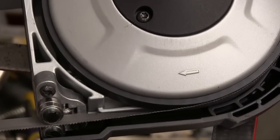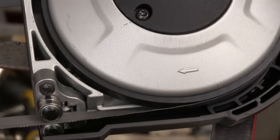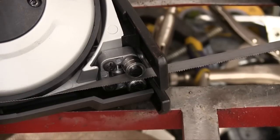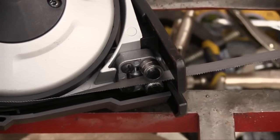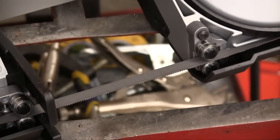The design of these tires and the rest of the blade drive system keep you from having to adjust the tracking. Because the blade has to be twisted where it goes through the blade opening, Milwaukee builds in these tough ball bearing guides. There are identical sets of ball bearing guides on both sides of the opening.